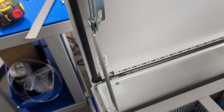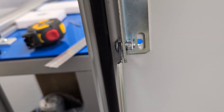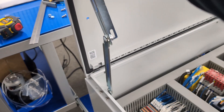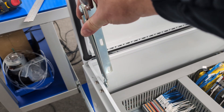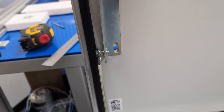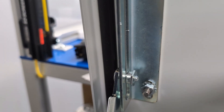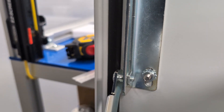Two of those latches that I used yesterday — I'm going to put the other one here on the smart cell. One thing I noticed: it's not really that positive when it latches in. It doesn't say to do this in the instructions, but if you get one of these, take it to the bottom here and just bend that over a little bit. That'll make it positive — they have to press it to release it. Now instead of being a little floppy, as it gets up into that latch, it pops out.